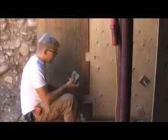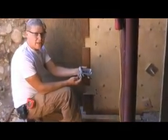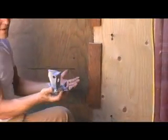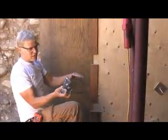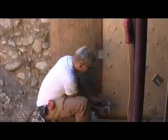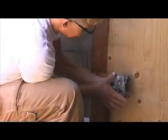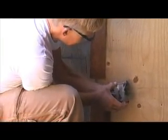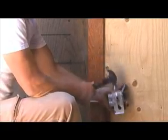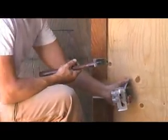If you're not using a type of reinforcement on the plywood, you use these, which are full-length reinforcement pieces. Usually you do some form of reinforcement. This is designed for low wall applications and for other areas on plywood where you don't require the reinforcement. These go like this. Now these will tighten completely down, and it will tighten it right in here, so it's very, very tight.